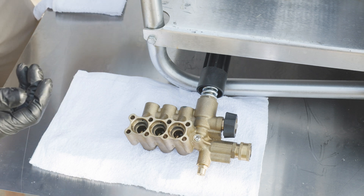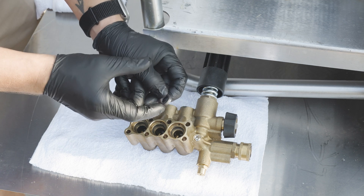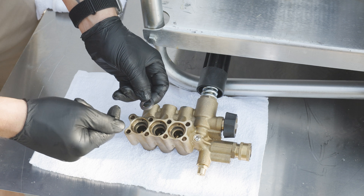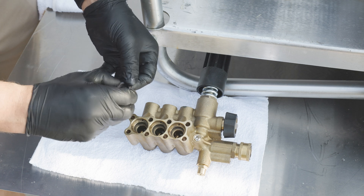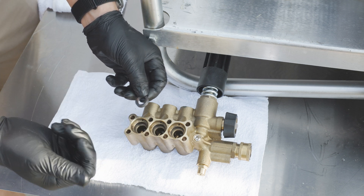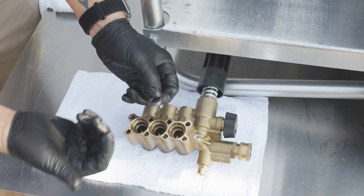The next step is to take our seals and work them in. If you look at these, you'll notice there is a bit of a flare on the edge, so they aren't going to push right into the setting point. What we need to do first is make them a little more pliable — set them in some hot water for a bit, which will allow them to become more flexible. Then during installation, set them in at an angle and work the outer edge until you're able to push them down.